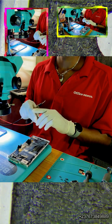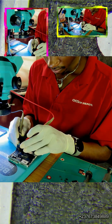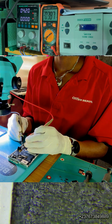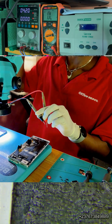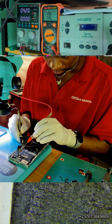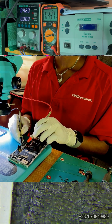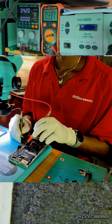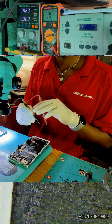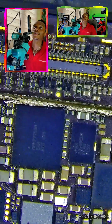When I saw this, I've worked on a couple of pixels with this type of fault and it was very easy — I'm familiar with it — but this phone is different. That was a small current trigger. The battery connector is within a 337 diode reading and that reading is okay for the VBAT.